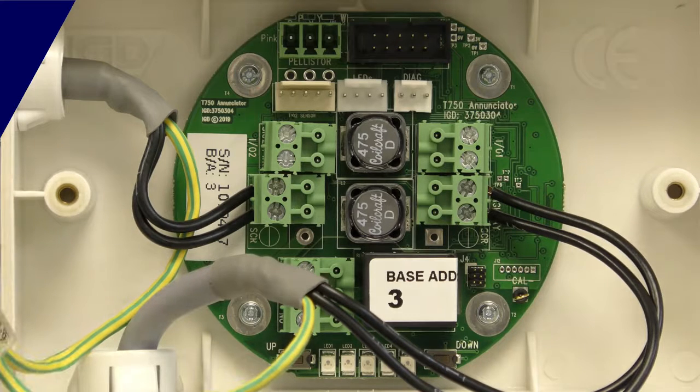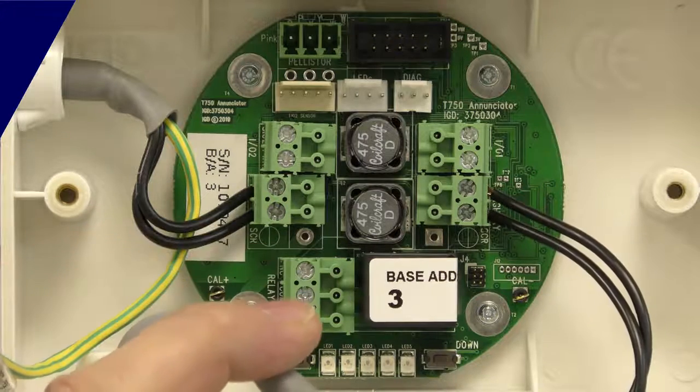This gives you the capability to distribute the control for the system so I don't have to wire all the way back to the control panel to get a beacon sounder output or to control the solenoid valve. I can wire directly to the nearest detector and control those devices from there by changing the cause and effect on the panel — minimizing to the absolute bare minimum the amount of cabling needed for a system to fully operate.